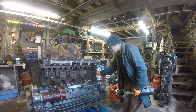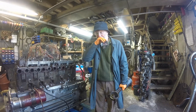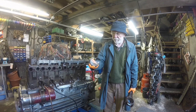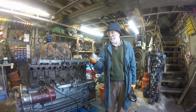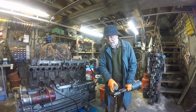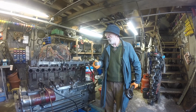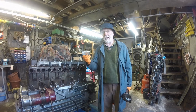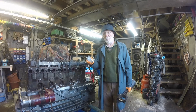This is an example of the shells here. The shells are coated with a special lead copper coating, which lasts a long time under a lot of stress. They are a very precise fit in the big end, and they bring about a really quite effective seal around the journal on the crankshaft. That determines the whole health of the engine. If these are a loose fit in the big end, then you have very little oil pressure inside the engine, and that's a formula for disaster.